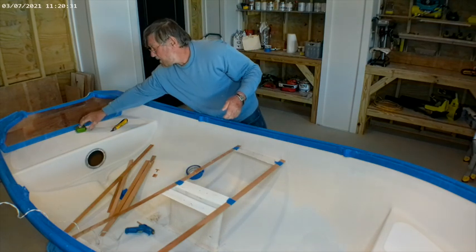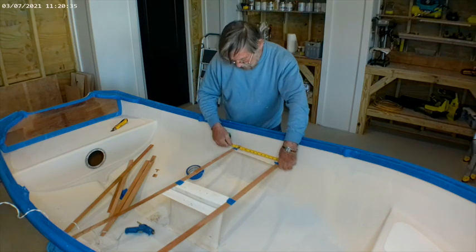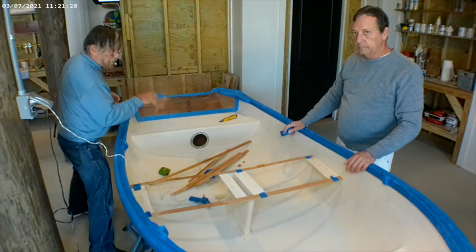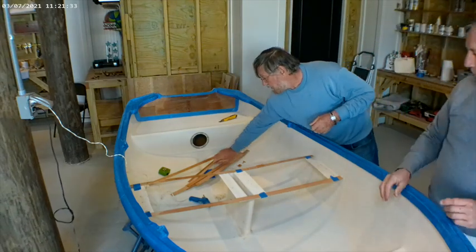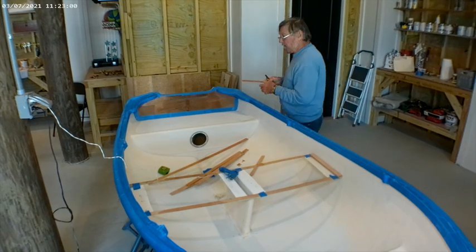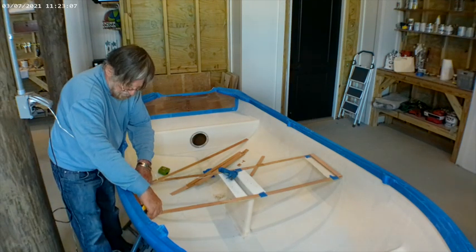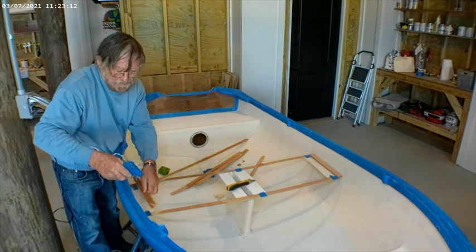Take a tight measure and make sure that we're making these parallel. So we have our two parallel pieces. Now we'll tack these together to make sure they stay where we want them. We do this on both sides to make it quite stiff, and to give us a shape on both sides, which will be different — one side or the other may not be the same.